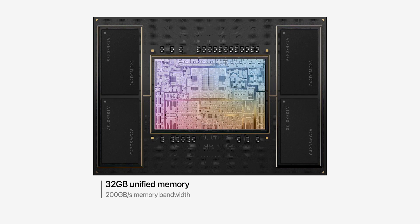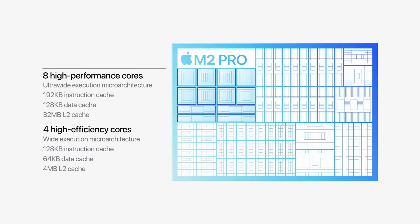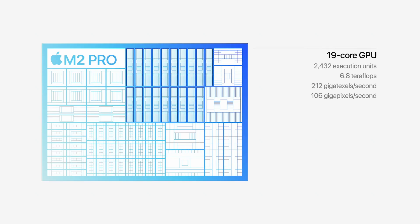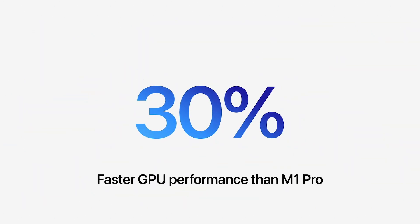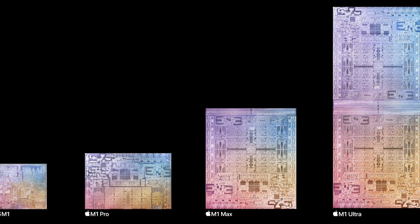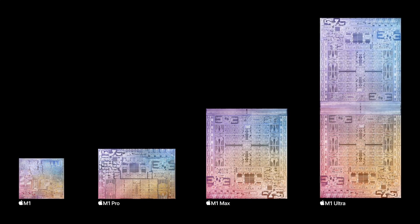The rest of the chip hasn't changed that much, especially since the base M2 chip has been available for quite a while now, and the M2 chip family is based on the same TSMC N5P process node used for M1. The NPU gets a performance bump, encode and decode units are improved, and with M2 Pro and Max, the display engine finally supports HDMI 2.1 with high resolution and high refresh rate output. Apple has kept quiet about a potential M2 Ultra so far. Chances are very high that the next Mac Studio refresh will unveil an M2 Ultra version, especially since the Ultra is just two M2 Max chips with a high-speed die-to-die interconnect, so Apple doesn't have to design a new chip. The M2 Max die shots don't show any interconnect areas, but Apple also omitted that when they first showed the M1 Max, so I think it has been removed from the die shot on purpose.